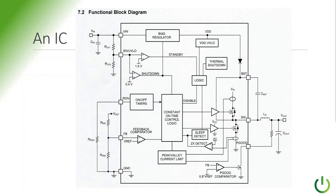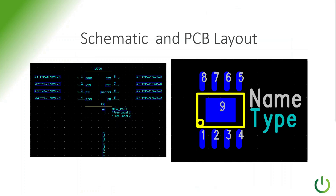We're going to show how that gets implemented in both the schematic capture and the printed circuit board layout. The picture on your left is from the schematic capture CAD system. It shows the nine pins on that integrated circuit and gives you enough information to know what each pin is used for — for example, GND stands for ground, VIN is voltage in. On your right is the physical layout of that small integrated circuit and how it goes on the printed circuit board. You have to make the logical tie-in with the physical that goes on the board.